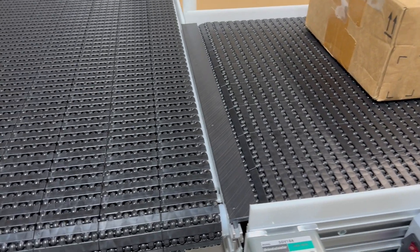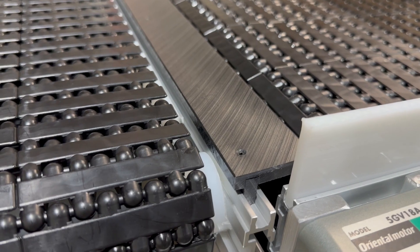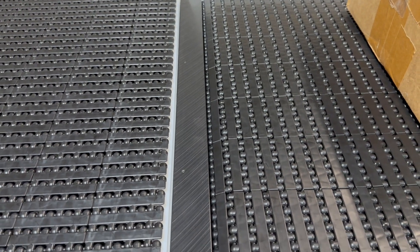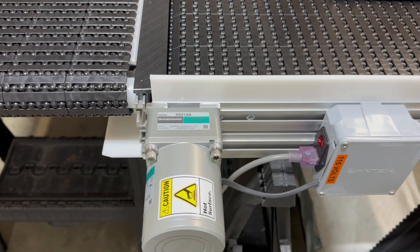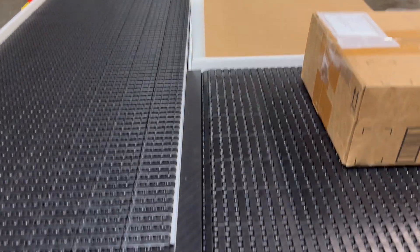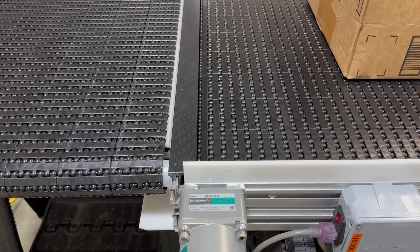In our case this is a lower frame, so we actually have enough room to install a transfer plate. If you want to move small product, you're going to have to consider how far away the drive is from the end of the conveyor. Even though we're turning on the end, if you were trying to turn somewhere down the middle, that motor might become an issue. Those are just some of the factors to getting a turn.